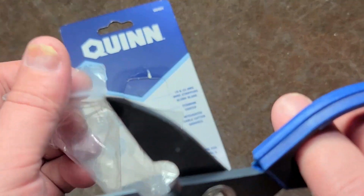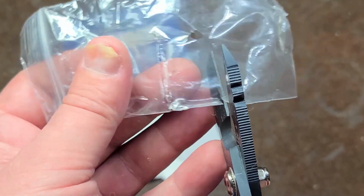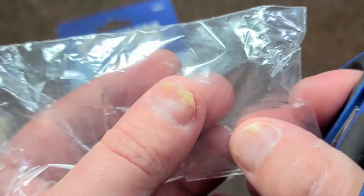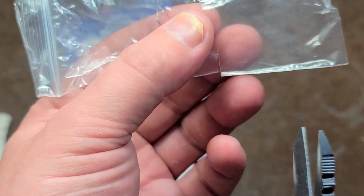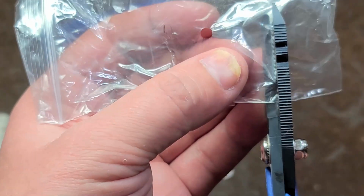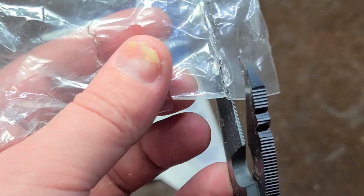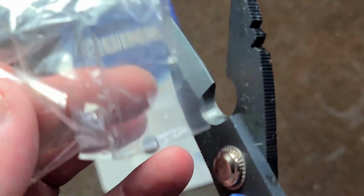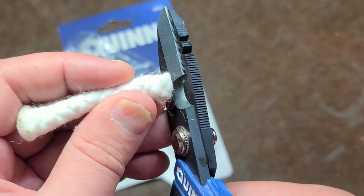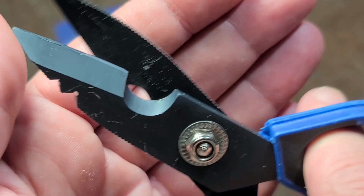The one thing I'll admit is at least they have a halfway decent grind, so they will generally cut plastic, but it's not super great. And that's kind of disappointing, because this is a pretty thin plastic, and it's a pretty good test because the plastic wants to stretch. Unless you have really sharp, well-ground jaws, you'll have this issue where it just does not really want to cut. If we get down here, sure, it works a little bit better. But in this area, which is ostensibly called a cable cutter, it does generally work okay, just because they have a very tapered edge on both sides.